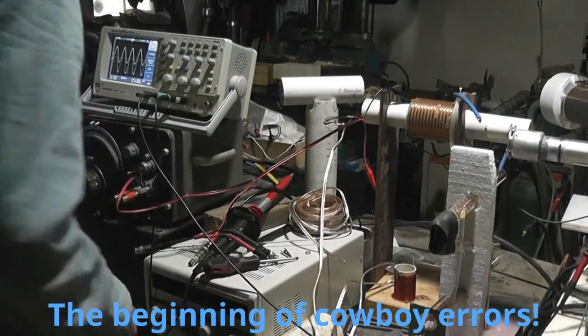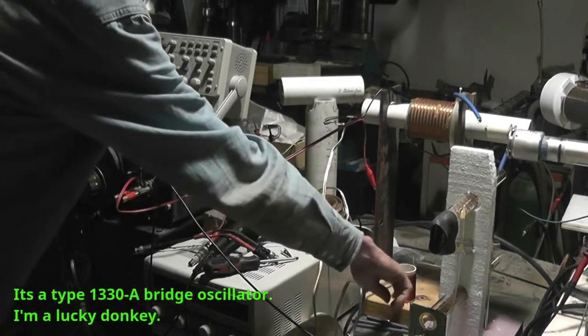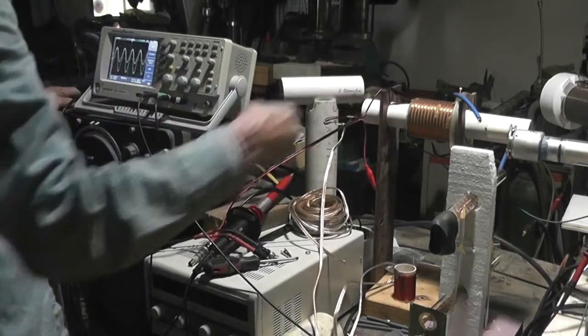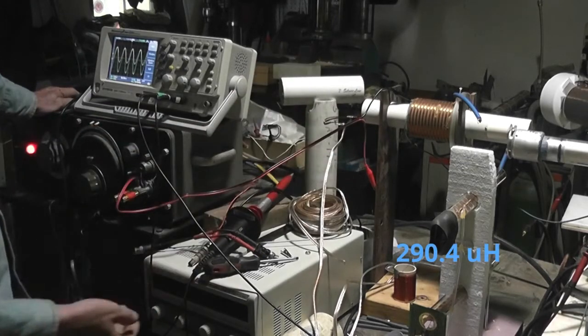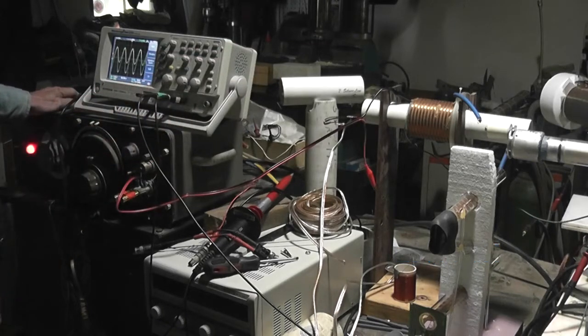Okay, I'm having a little fun with dynamics today. I set this thing up with this wonderful old General Radio signal generator, and this coil down here in series with the Fusor electrode. I'll mention the microhenries later, but it's 100 or so turns on a 1.5-inch pipe. This thing is a monster.